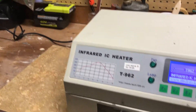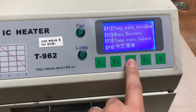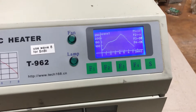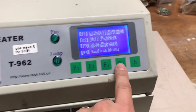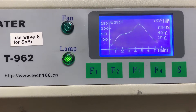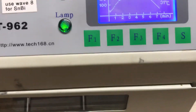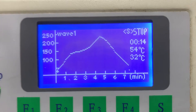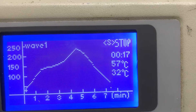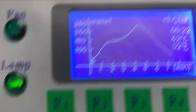So it powers on, and if I press the buttons — they're a little finicky — and start going through the profiles and select one, then go to auto-execute. As you can see, the lamp light is on, but it's actually not heating. You look at the drawer, pull it out, but those little asterisks are supposed to be the actual temperature, and the set point is the waveform. The asterisks aren't matching the waveform, so no heating.